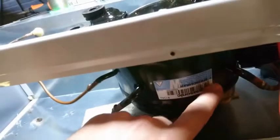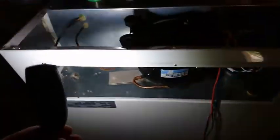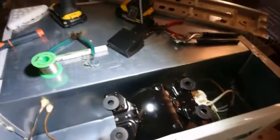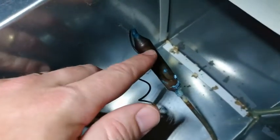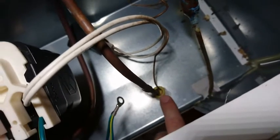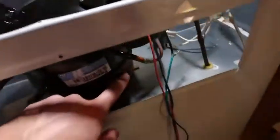I don't want to drill through any of the pressure lines, so I'm looking carefully. The compressor has suction labeled there — that's the low-pressure side, that's the high-pressure side, and that's just a fill port. The high-pressure side comes out of the compressor, goes into the bottom of the freezer. I suspect there's a radiator that runs across, then goes down the back where there's another radiator, then comes out the other side through some kind of filter or pressure shunt, through a fine tube, and then goes back down into the actual freezer compartment. It sucks up heat from inside when the gas goes from high pressure low volume to low pressure high volume, comes up out of the pipe and goes back into the compressor.